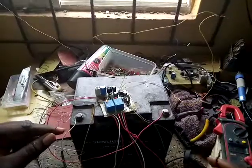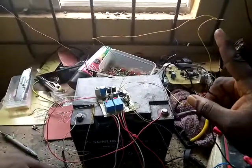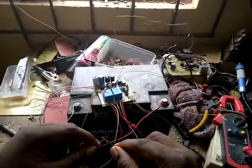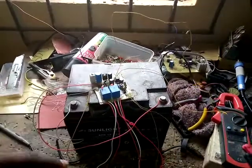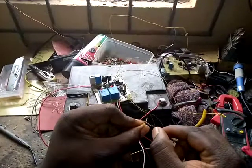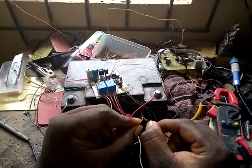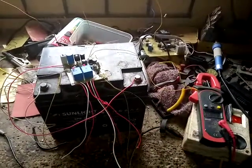Let me try to connect the mains again — I've connected the mains. The generator has not started because the switch is connected. Now I'll remove the switch and try again. Once it senses the mains is out, the generator starts and stops cranking. Once mains returns, the generator stops. If mains is not sensed, it cranks the generator four times. Very simple, straightforward, and easy to use.